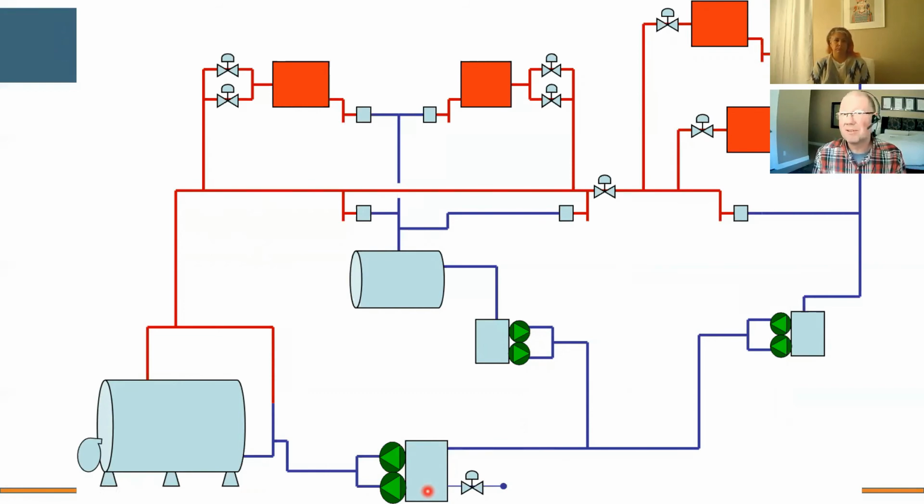A disadvantage, I would think, would be efficiency. You might need to add an economizer to the boiler venting to up its efficiency. An advantage on the boiler, you could run it on biodiesel, propane, or light fuel oil, different fuel sources than you might be able to accommodate on today's standard condensing boilers. Forgive me, it's a really good question. It's loaded. Design criteria might be another one. If you can find an engineer who's comfortable with steam, that's great. There's a lot of individuals who might struggle on that front.